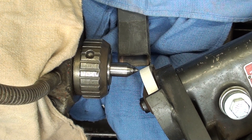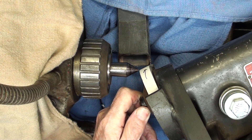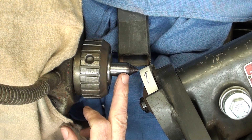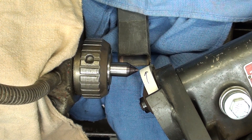Again this will be loud — I will not speak during the actual grinding. The grind wheel is rotating in this direction, so the lathe must be run in reverse at 400 or 500 RPM. Also I might add that the carriage is locked.